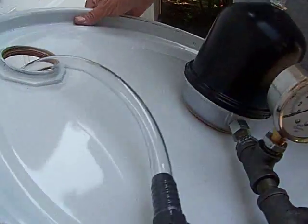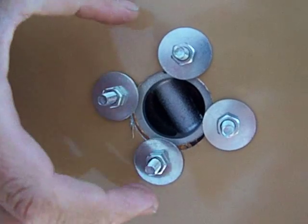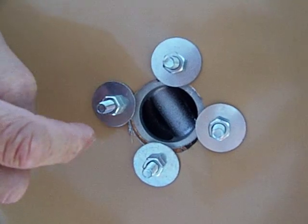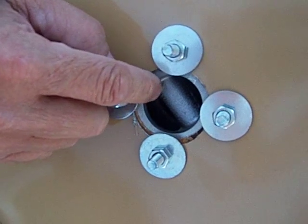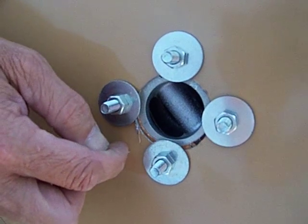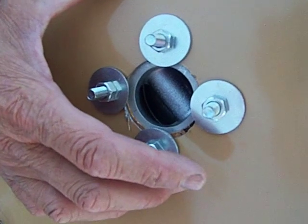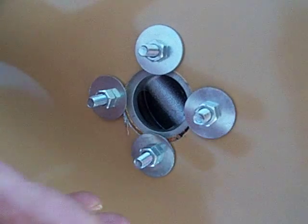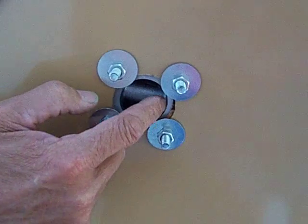Let me show you the base. I like the banded drum. We used a 2 inch hole saw and used the gasket as the template, with 5/16 inch bolts. The major thing is when you're cutting the hole, the hole needs to be as large or larger than the hole on the base of your centrifuge. If the centrifuge base hole is larger than what you cut, the oil has a tendency to lay there and build up accumulating in your base and it'll slow down the rotor — it'll bog down your centrifuge after a bit. So just make sure your hole is larger than the base, as you can see right there.